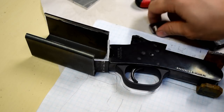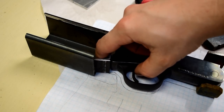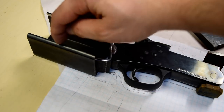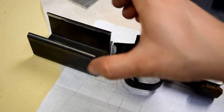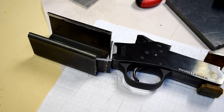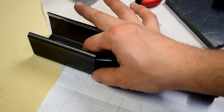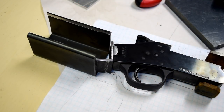Angle iron piece. This little guy is going to slip down here. No room for it right now, but anyway. That's going to go down there. This is the 2-inch square tubing. It's going to be cut probably right about here. It's a little bit big, about a quarter of an inch taller than it was designed to be, but that's the material I got. So I'm going to weld this onto here. I'll probably just tack weld it to get started, get everything laid out, and then I'll start shaping things together.